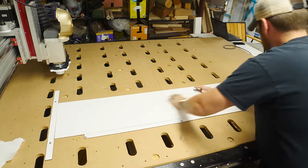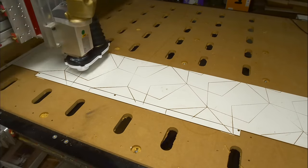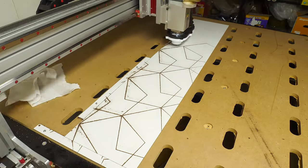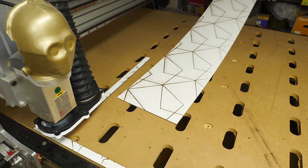I haven't gotten around to fully flattening the CNC bed yet, so there were some high spots and low spots when we cut. But the solution was pretty simple — we just turned the pieces 90 degrees and they cut really well that way. After we had that process down, we cut all four panels the same way.